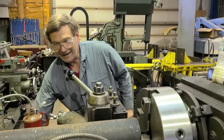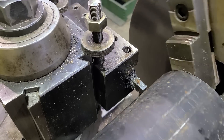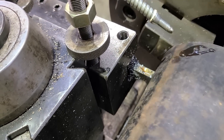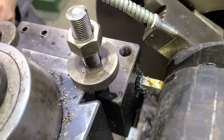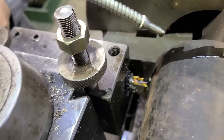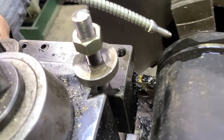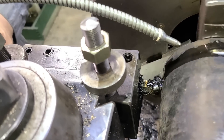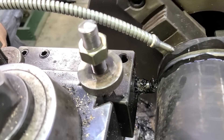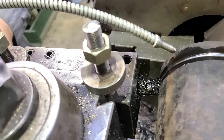Slower turning lathes are an advantage here — that was part of why I purchased this particular lathe. It shipped at over 8,000 pounds; comparable lathes were under five thousand, so that was a good plus. You'll notice the pipe is out-of-round when you first start cutting. If you go faster it will chatter. My bit is slightly not square across the face, but there's a plus or minus 20 thousandths depth on the spec, and we're within spec when we're done.